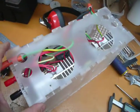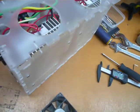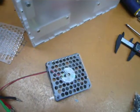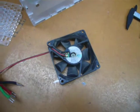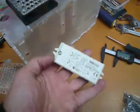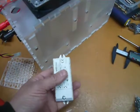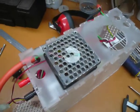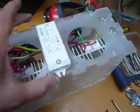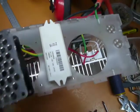I've just popped some holes for my fans into the bottom and the sides of the control box here, and I've also made some panels just to go over these fans. These are covers to go over the 80mm standard computer fans — I'll pull these out of an old desktop unit I don't use anymore, and they'll bolt on there. There are four of those and they're all going to be run off this 240V AC down to 12V DC transformer. It's got enough grunt to run just these four fans, and that will fit nicely between those two heat sinks on the other side of that panel.